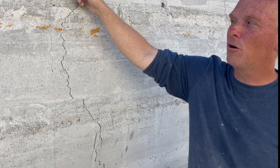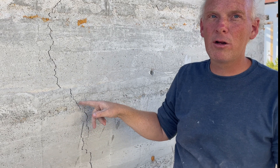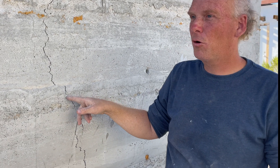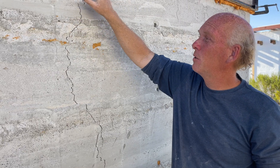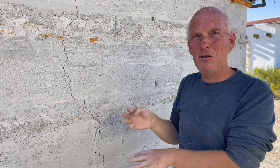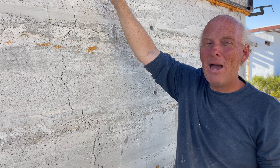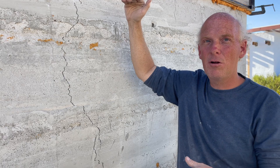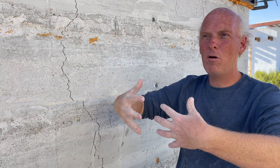The cracks are one of the things that turn most people off of AirCrete. But these cracks don't go all the way through, and all concrete cracks — the concrete your house sits on has hundreds of little cracks, and the bridges you drive across have cracks. When you've done the math, you know you've got less than two pounds of pressure at the very bottom of this wall when it's brand new, giving you a massive safety margin by the time it cures to 160 or 170 pounds per square inch. And because it's all bonded with a bond beam, it's held together.